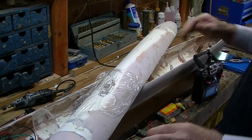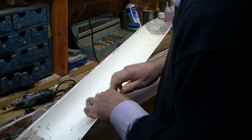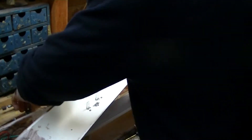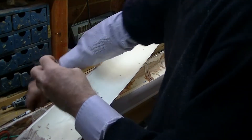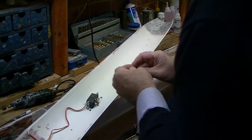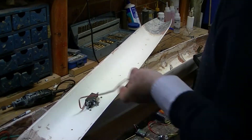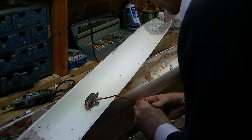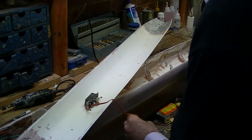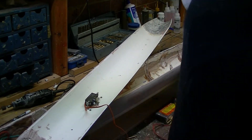That's now nicely in place. We now add the servo, and you can see underneath I've had to drill into it so it'll cut in here. I've had a couple of goes at these holes because I placed them wrongly to start with. I'm going to take this off and assemble these with their screws. This is nice and firmly in place, held by those two screws plus the hole. I'm going to turn this on to make sure it's central as I set it up. I'll just disconnect it — that's not going to move.